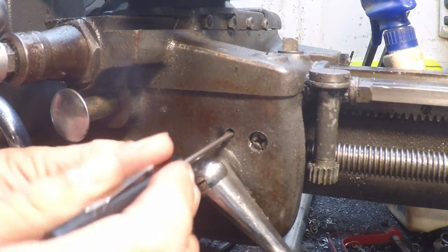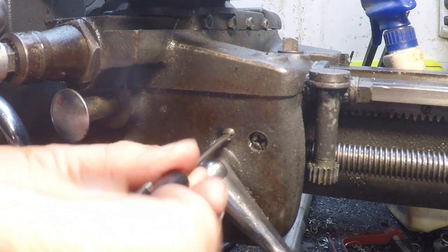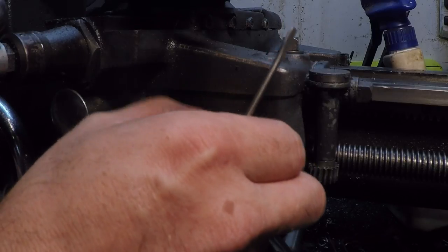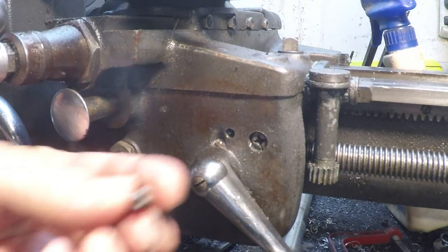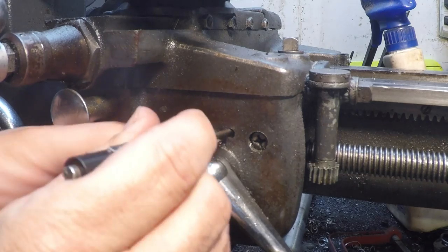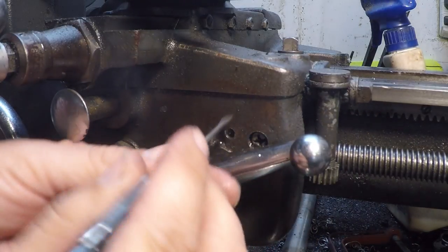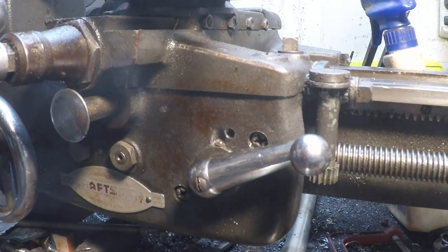The detent is in here, so we'll take out this set screw. This is an original set screw — you can see it's got a flat head. If you had a milling machine this would be a fairly easy project; you could start with a screw and use a slitting saw or something like that. It's got a dog point on there. Let's see if we can get a hold of the spring — let me stop here and get a pick to try to grab it.